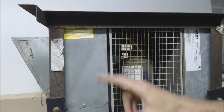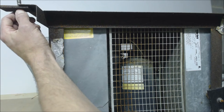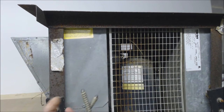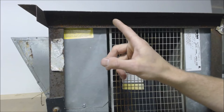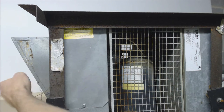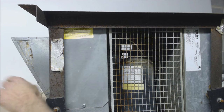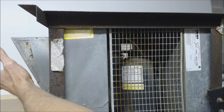This unit is actually mounted underneath the trailer, lagged right into the floor joists. You have four lags and plates. It has a four inch by four inch air opening on the top where it actually connects into the bottom of the trailer. Here is where you'd connect a 10 inch return, which goes to the floor grill wherever that is located in the trailer. At that spot in the floor grill is where the filter is usually housed.